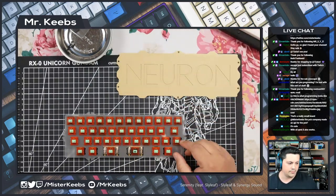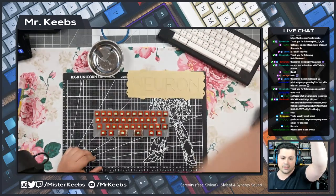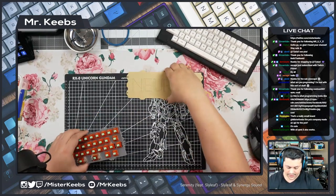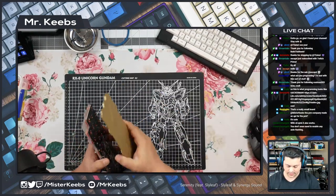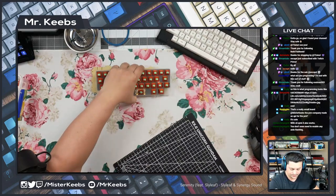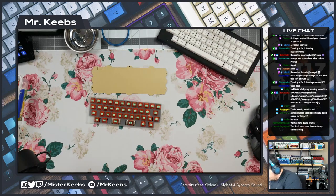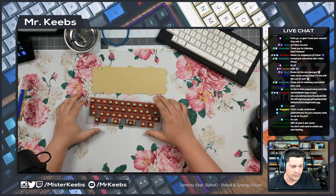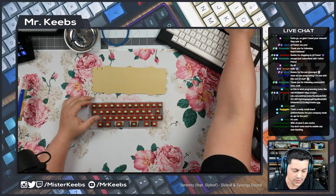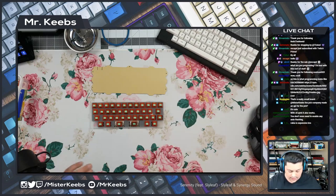The PCB company made an API for the PCB. Not exactly. What happens is there is this open source project called QMK, and it's basically a keyboard firmware that is open source, and you can create your PCB to support QMK. So that's what most of the keyboard builders nowadays do. It supports QMK, so you can program your own layouts and whatnot. It's almost like an API.